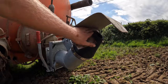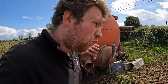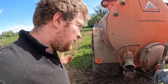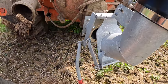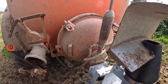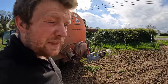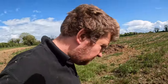Basically all it is — it comes right flush down and just helps guide the slurry. The big issue we've always had, especially with the dribble bar tanker, is blowback — the slurry blowing back onto the dribble bars. You've seen it, it's always bloody filthy. Father Phil said he was very happy with it, very little blowback, dribble bar staying a lot cleaner. The other thing with this is you can fold it up, so if you have anything stuck on it it's easier to sort out. It's also slightly shorter back to the tanker.